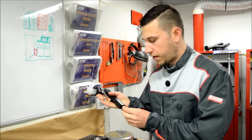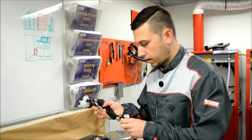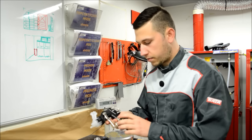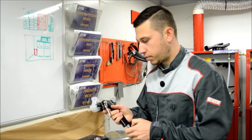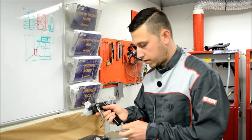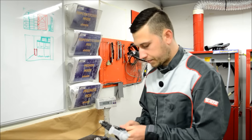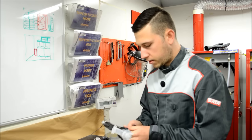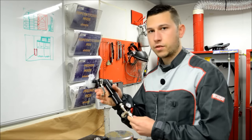We also need our pressure gauge, so we can just put this one on. This comes with the kit we've got today. The gauge goes at the bottom because there isn't any pressure adjustment on the actual gun itself, so you will need a gauge on the bottom. I'll tighten this up in a minute with a spanner just so we don't get any leaks. So that's the gun setup — we've got everything we need to start spraying.